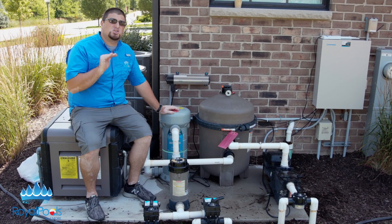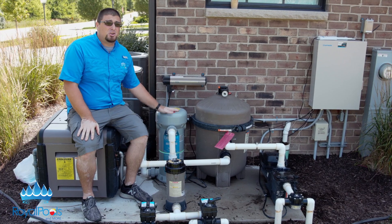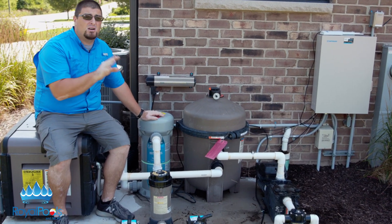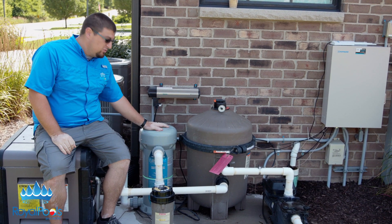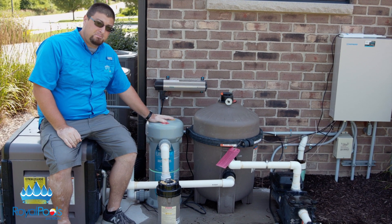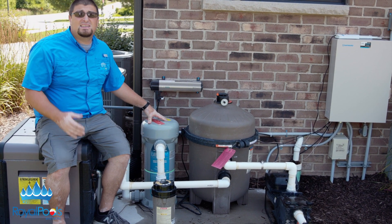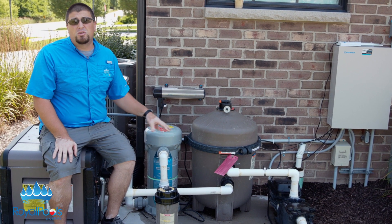What they do is allow you to run your swimming pool with very low chlorine. In fact, when these two are combined, you can cut your chlorine down by 90%, which is huge. The pool does, unfortunately, still need chlorine — we still need to give it that little boost of disinfectant. Just to put it in perspective, this UV tower here has a light that goes down the middle. Water flows out of the heater into the system, and the light is so strong — it's ultraviolet light — and it burns bacteria, it burns viruses. In today's day and age with coronavirus, this light will actually burn coronavirus right out of the water along with chlorine.